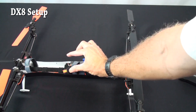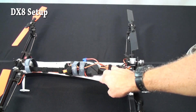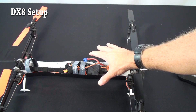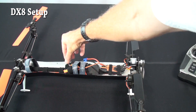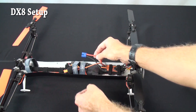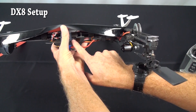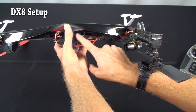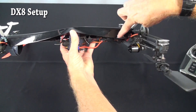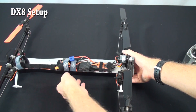He's also got all the wires well bundled up and held tight together. He's got the ESC wire run out separately, and all the servo wires running up underneath the boom — that's good for reducing any radio noise. His antennas are out and open so they can work properly, not bundled up tight. He also has the satellite, the extra antenna for this receiver, up underneath the plate, so it gets good signal from the bottom of the model and is isolated from your ESC and battery wires, so there should be really no radio problems at all with this model, even at distance.